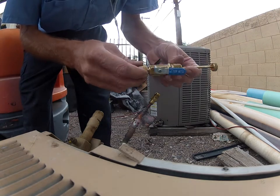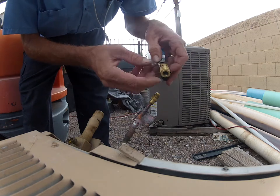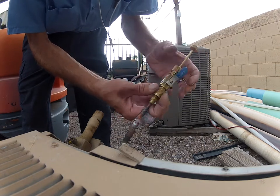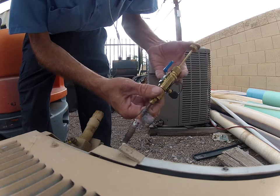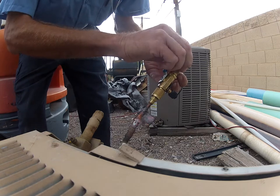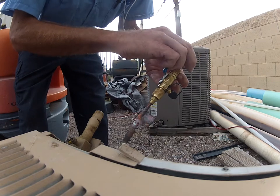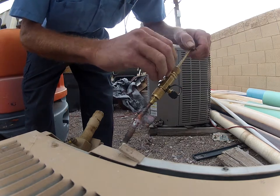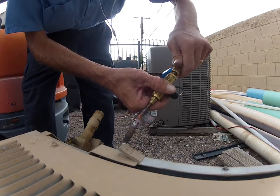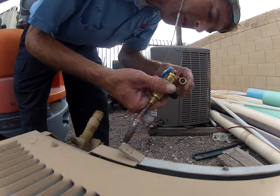On to the Yellow Jacket. This is a Yellow Jacket 18975. I noticed it does say 2013 right on the end there. So let's try this one. Tighten up, grab the valve — you can feel the resistance there. Feel it unscrewing. You can tell you're at the end there. Pull it up, close the valve, open up the end here — and no core.